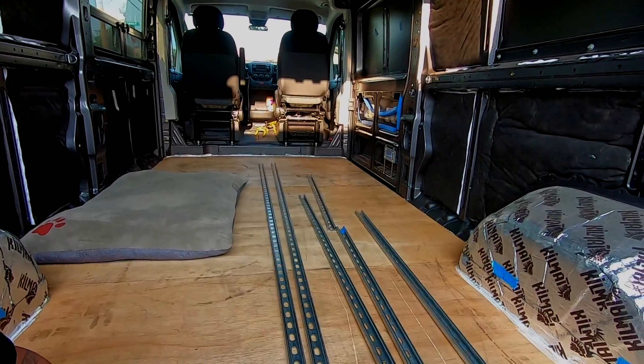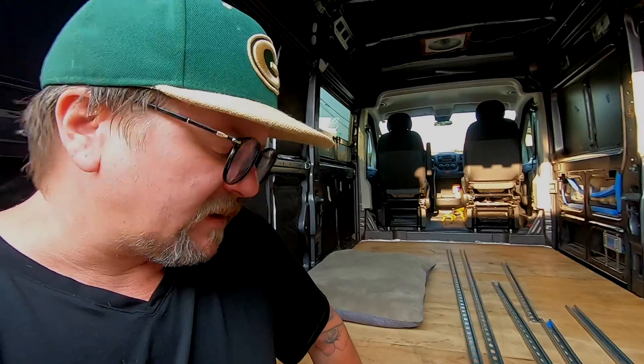Basically what I did is I framed this floor with one-by-one aluminum framing, 16th-inch wall thickness, maybe 16 inches or so apart. I'm going to use polystyrene hardboard insulation between the frames, and then this is half-inch mahogany Lauan. I gave it a coat of Thompson's Water Seal on both sides, and then obviously I'm going to have an actual good-looking floor on top of this. This is the subfloor and it's solid.